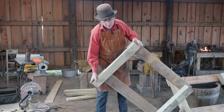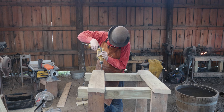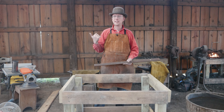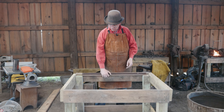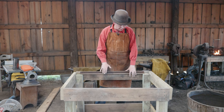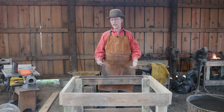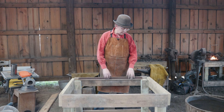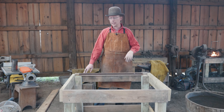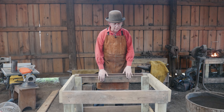The angle iron is an inch and a half tall, so I've got five and a half inch long boards — we'll mark off four inches. That should give us the right overhang. We've got our two front and backs done. Next we're going to flip this over; short pieces go on the side. I thought I had more angle iron in the steel supply out back but I'm out, so I'm not going to put it in tonight.